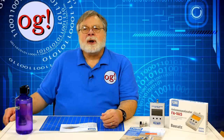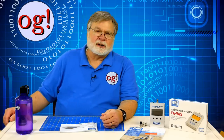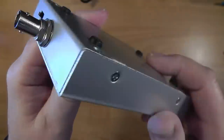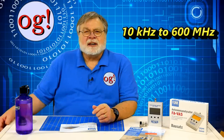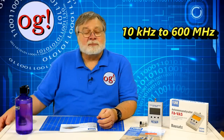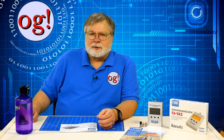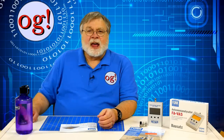This will be a great addition to your test equipment collection. Once you're done, the fit and finish is remarkable, and you'd never know it was assembled from a kit. The range is 10 kilohertz to 600 megahertz, so it covers the 70 centimeter band too. It measures SWR, signed complex impedance, and the complex reflection coefficient.